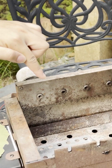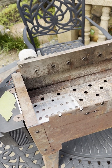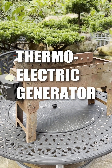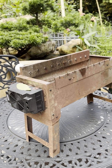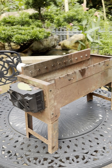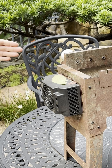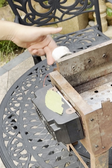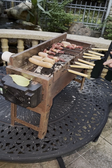Here is how it works. When we place the lit charcoal onto this aluminum heat plate, the heat gets transferred straight to a power generation module inside this black box. It's called a TEG. Its job is to turn heat into electricity. Once that happens, the first thing the power does is drive the small fan on the side. The fan is there to prevent the TEG from overheating, which also boosts its power efficiency. Then the electricity flows into the motor. As soon as the motor kicks in, it spins the rotors which make the skewers rotate once they are inserted. And our BBQ setup is running with nothing but heat.